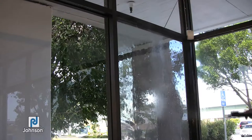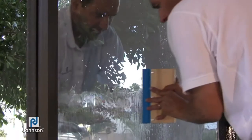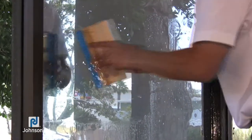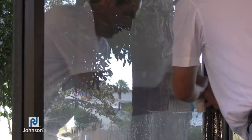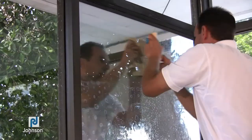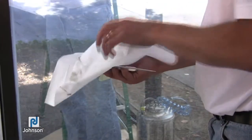On the second window, we'll show you how to do it the right way using an 8-inch wooden squeegee. Please notice that this squeegee allows greater pressure and most of all makes you push the water out. You will see that I am going to squeegee this window five times: three times using the 8-inch wooden squeegee and then twice using the 5-way tool.